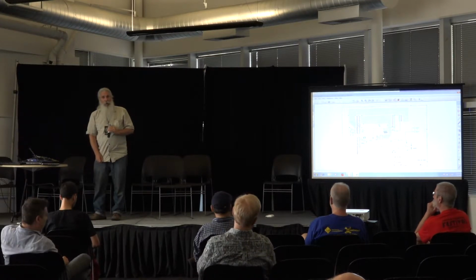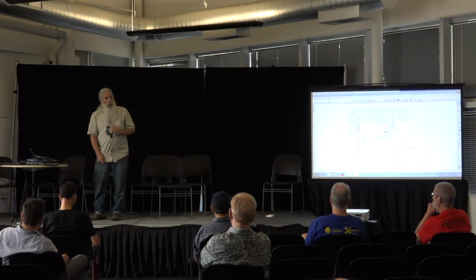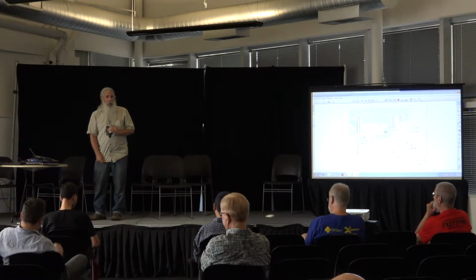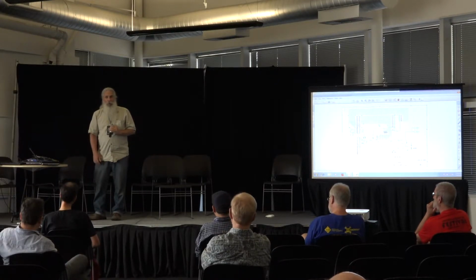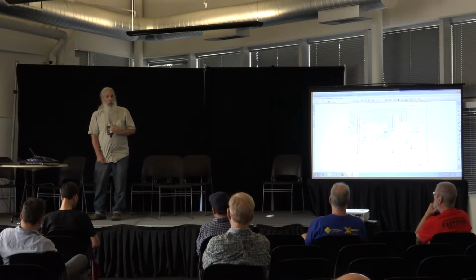And that's a more serious problem because, like I said, that's a mask part that's no longer available. People say that's the most common failure, but surprisingly, what I've seen is it's maybe about a third of the failed boards have that problem. Most of the other boards have something else broke. Either the RAM chips failed or something else has failed. So if you have a bad board, it isn't guaranteed that you're going to need to replace that 002 chip. It could be anything on the board.